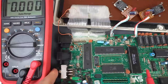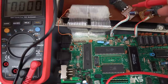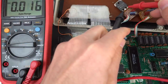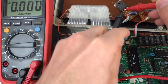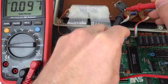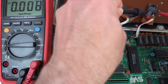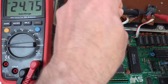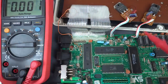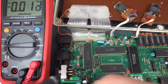Let's turn it on and start measuring. Ground over here and input. So our five volt regulator seems to be blown. What about the 12 volt one? Input is fine, but it's not - it's bad. So it looks like that one is bad. I don't know why that happened just now.